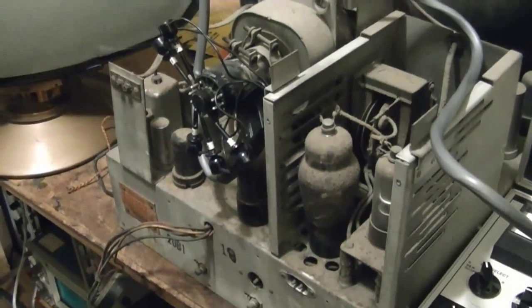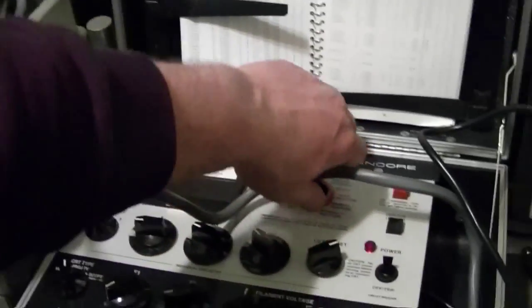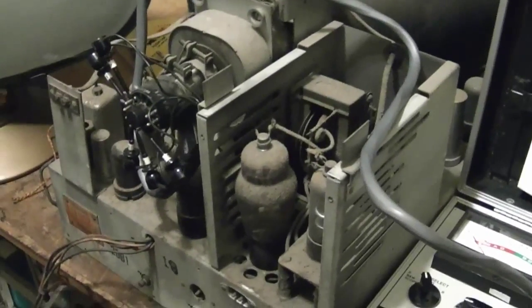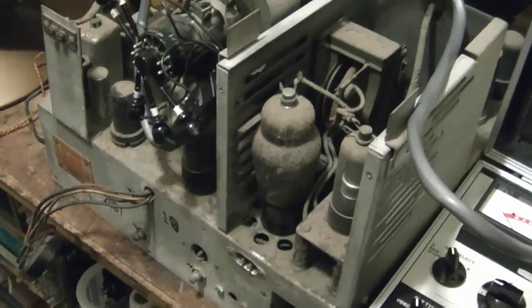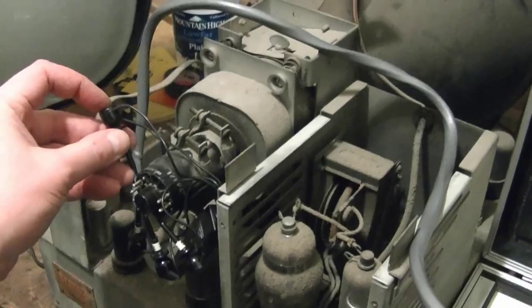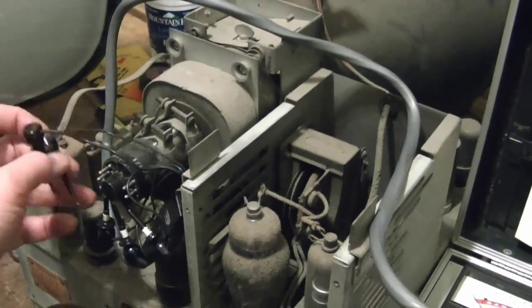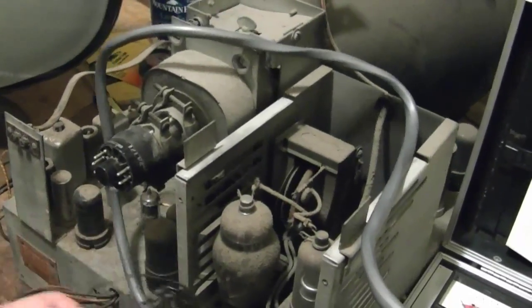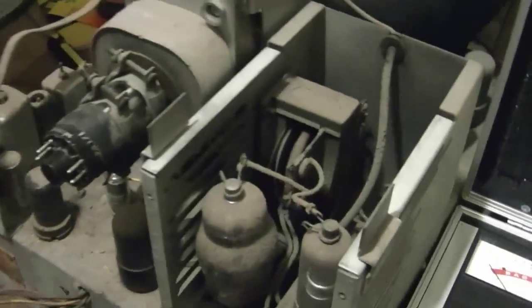Now I'm going to pull up the power supply and take a quick look at that. And assuming that looks okay visually, what I'm considering doing is tacking in a replacement for that one cap that's obviously failed and attempting a power up. I'm not as concerned with these sets because one, I know they're pretty darn rugged. Two, I've got plenty of spare parts. And three, these are fused.